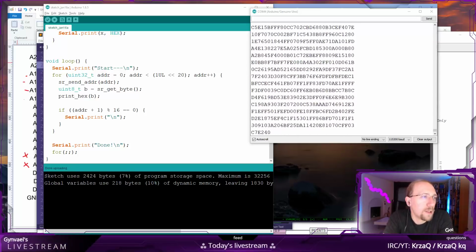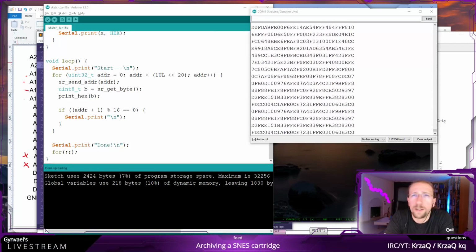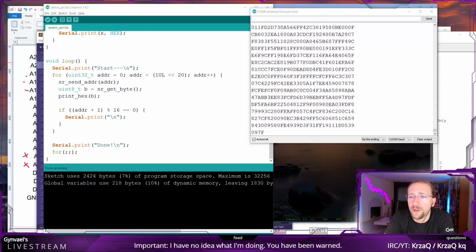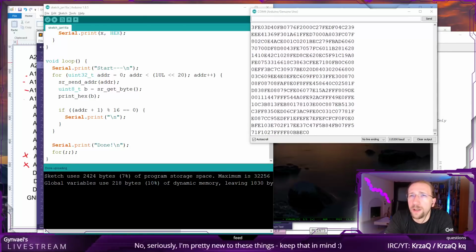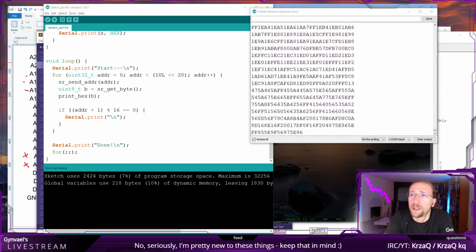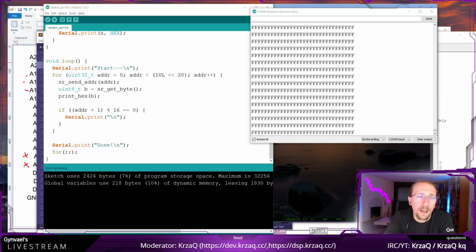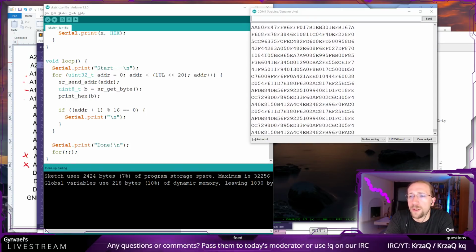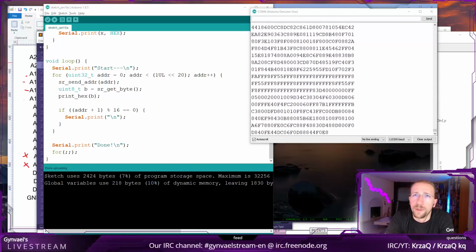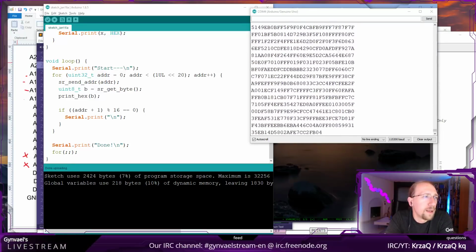The ROMs are read-only. You'd have to put a flash chip with compatible pinout. Yeah, so X41, you are absolutely correct. I do not believe there would be a compatible pinout, especially since I don't think flash memory is using a parallel interface, but maybe I'm mistaken. Again, it's probably easier to just do this using an FPGA or whatnot, but we can chat about it at the end of the year.